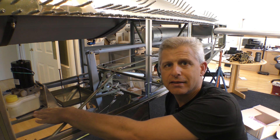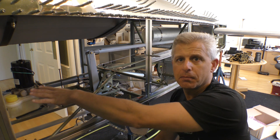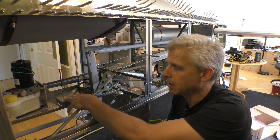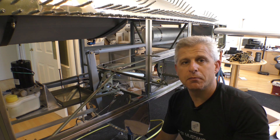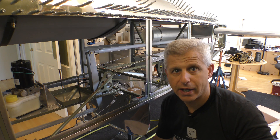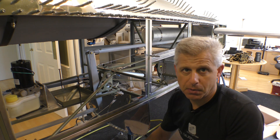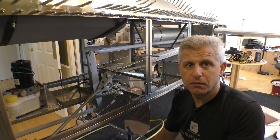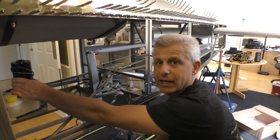The standard installation with the kit is to mount the pump assembly on a bracket that's right in front of the battery box. A couple of builders have been doing some different things about locating it, and we've been encouraged by the factory to look for ways to put weight as far back as possible, because that helps the CG of the aircraft. Titan has been very open about saying it's okay to relocate things, and this is a very heavy component.